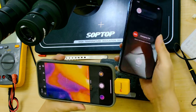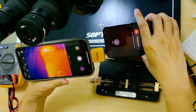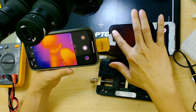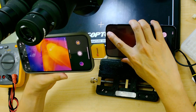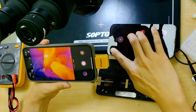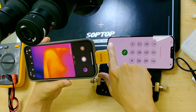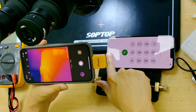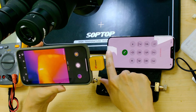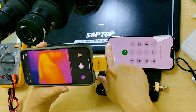The temperature here is not that warm anymore — it's cold now. Checking with the thermal camera, I don't see the heat anymore. I put my finger beside the screen — you see my finger is actually hotter than the screen. So when the screen is running, we shouldn't have any heat on the lower side. Our finger should be almost the same temperature as the screen, or maybe the screen is lower — not like 45 Celsius.